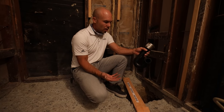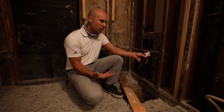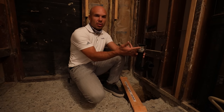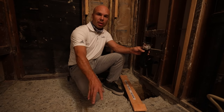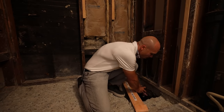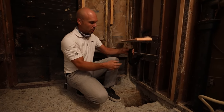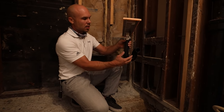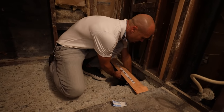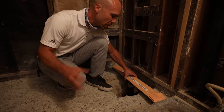Since we have concrete, we're going with inch and a half. When you tear out your tub you'll have inch-and-a-half waste pipe, and you'll have to decide whether to reduce right at the drain or run two inch all the way back to the sewer trunk line — sometimes it's easy, sometimes it's not. Always have a trap under your drain — what the trap does is trap sewer gases so they can't come up into the room. The trap filled with water will sit in there; we'll wrap the pipe, fill it all with concrete, and create the mortar bed.